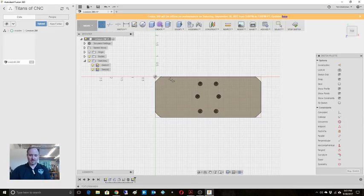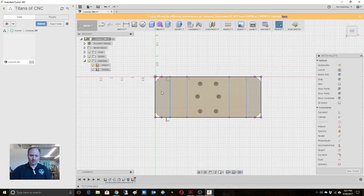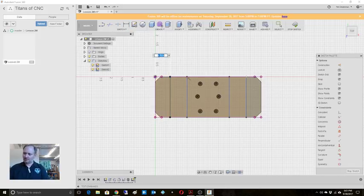All right, so let's draw some lines. I pressed L for line, and I'm just going to start drawing some lines here, just to say that there is something here. Could have done rectangles as well. Just the way I chose to do it this time. And we're going to dimension this, and we know, whoops, what did I just do? D for dimension, there we go, this to this is supposed to be 1/2 inch. And again, remember, we're working from that corner, right? So this next one is supposed to be at 1.5. I guessed that one right. That's funny.